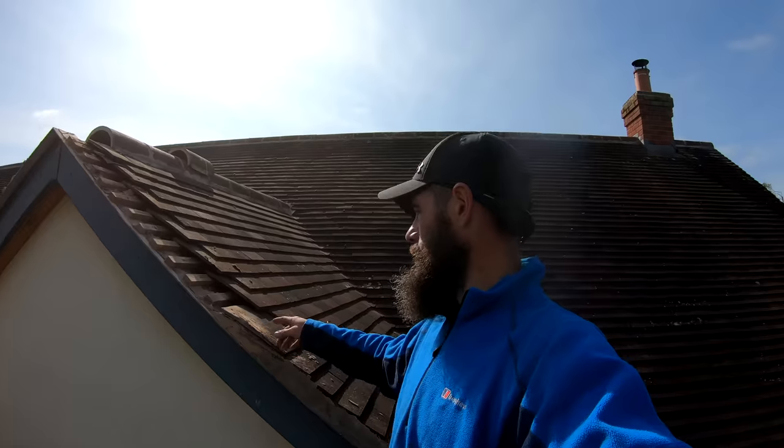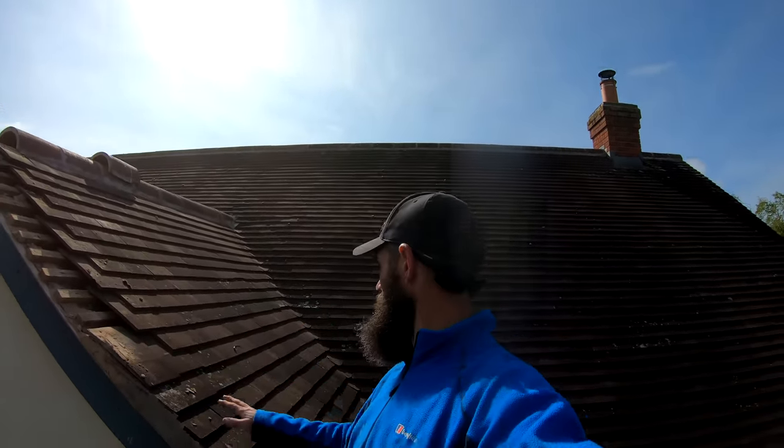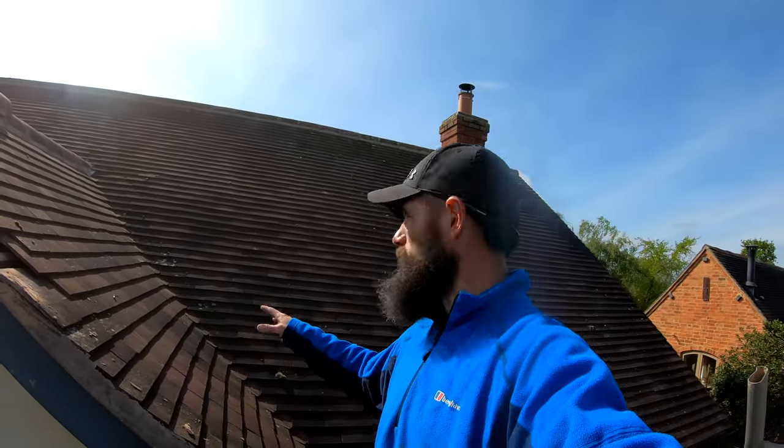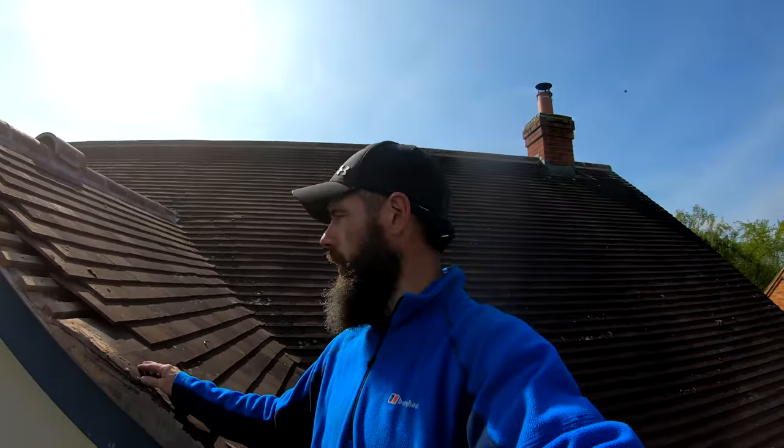So that's the plan. Lucky for us, on this side and that side over there, what we've got is tile and a half. So that allows us to just switch sides. If there'd been a tiny little cut on this side and that side, you know for a fact it wouldn't have worked out and we'd have ended up having to cut tiles. We really don't want to get new tiles for this roof because, as you can see, the tiles are already weathered in. If you stick a new tile on here, it's just gonna stick out like a sore thumb. So we're trying to save as many tiles as we can.